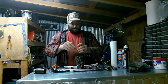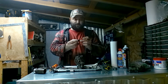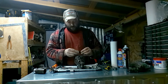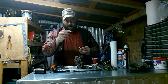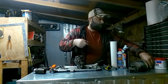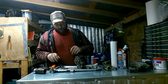You see there's a spring that'll go in through the side without the stud. This little cap here goes onto the spring. And then you got one of these little detent plates, one going up against the plunger, and the other one right up against the piece that just unthreaded out. So let's try to keep these together here, kind of in their own world.